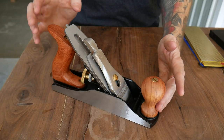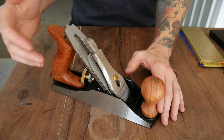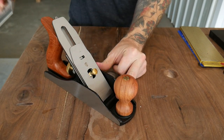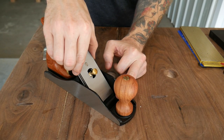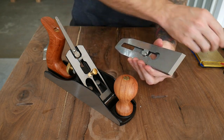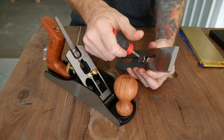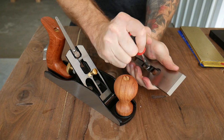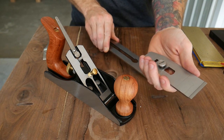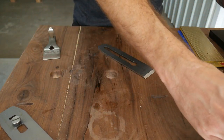This blade has never been taken off the frog at all. So we're just going to disconnect this, pull it up on the lever. Take your blade out and bevel. Now this is the reason you want to have a flat-head screwdriver — a little stub will work — just to loosen it up. The back bevel you'll lay over here, move the plane out of the way.